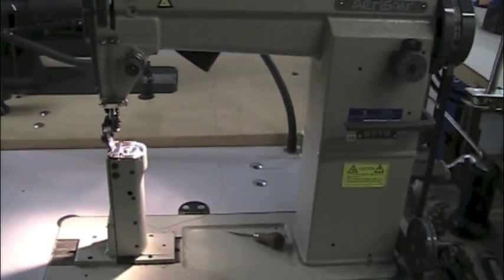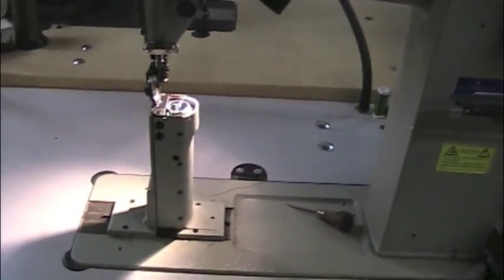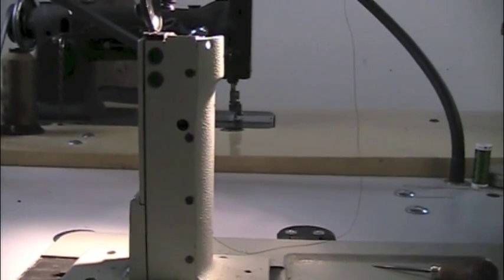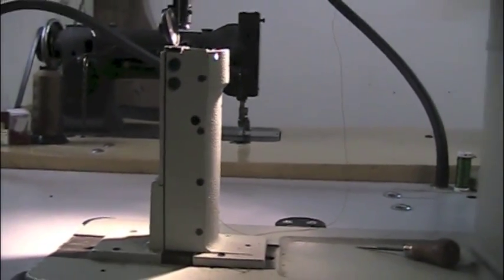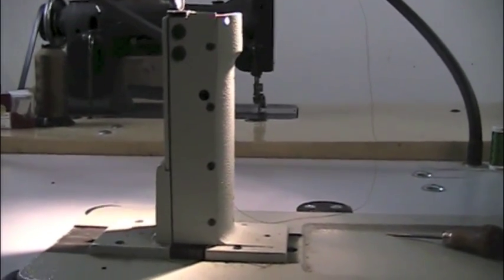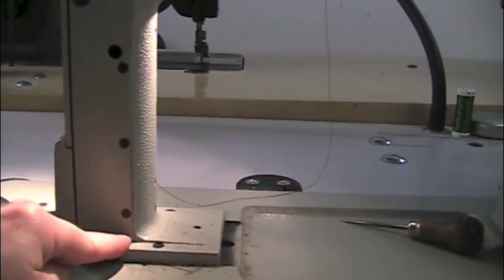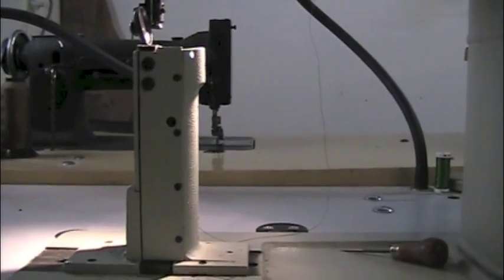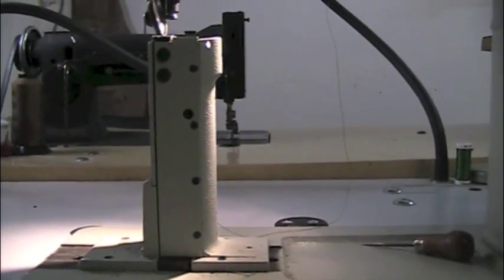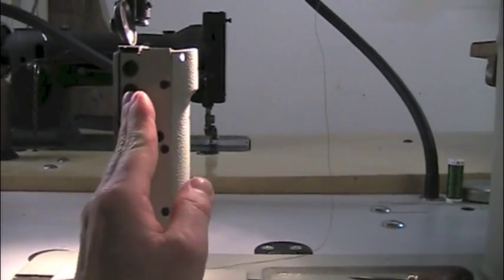I've had a couple of old used post machines and was never really satisfied. One of the things you have to be very careful about when you buy a used post machine is to make sure there's no crack in the post. This post is really vulnerable to being broken. The second one I had a hairline crack right there — it took me a while to find it because it wasn't very visible, but it allowed the post to move back and forth ever so slightly. So I would have some days where the machine worked great and other days where it refused to sew at all.